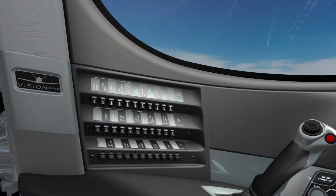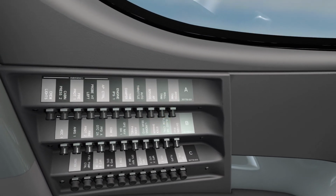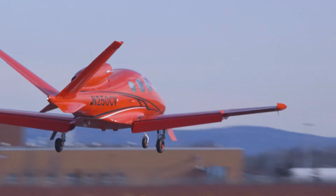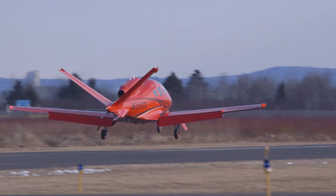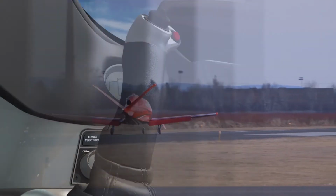Once the aircraft is under control, you'll need to pull the associated circuit breaker. This will remove power from the trim servo. Regardless of which trim system had the problem, you would follow these actions by landing as soon as practical.